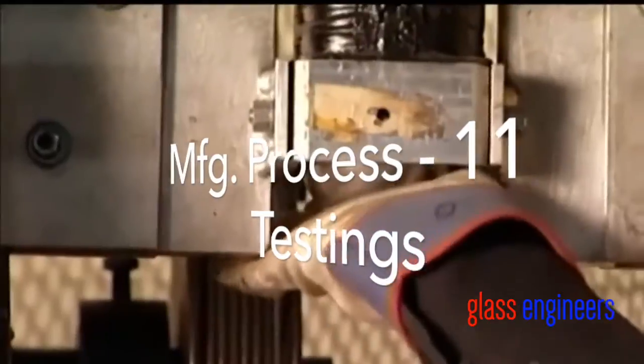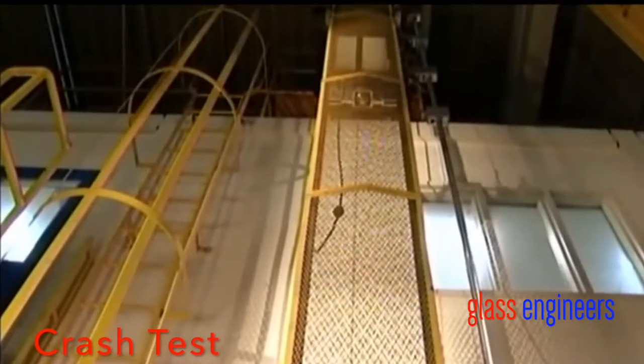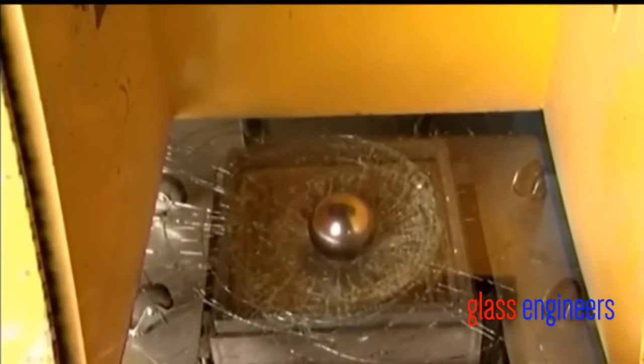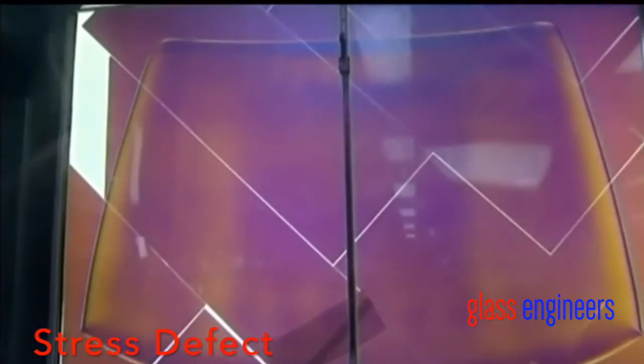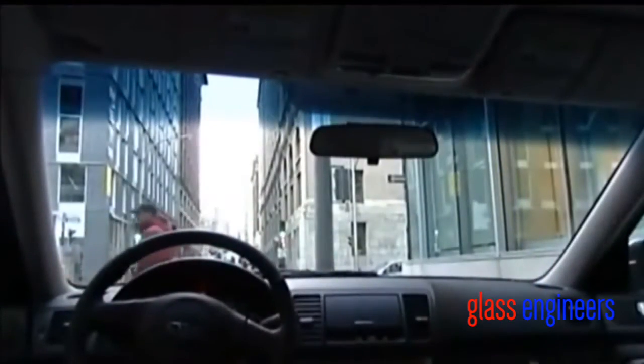They place a two-and-a-quarter-kilogram steel ball into a pulley system that raises it four meters high — this is a crash test for a sample windshield. The ball represents a driver's head. The ball hits the glass but doesn't go through, which means the windshield has passed this safety test. They also view the windshield through polarized light, which reveals stress defects, but only a trained eye can spot them. Once it's decided that everything looks good, the windshield is ready for the road — and the view from the driver's seat is now as clear as glass.